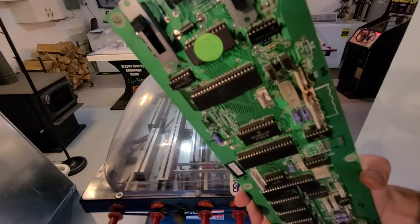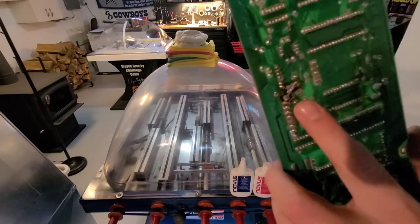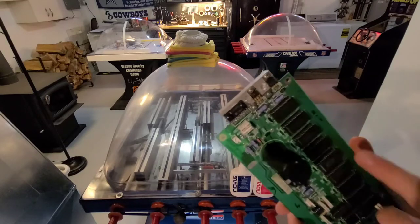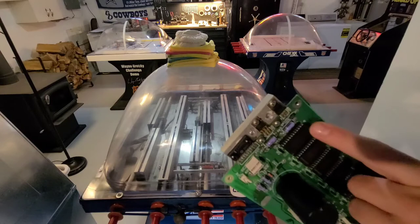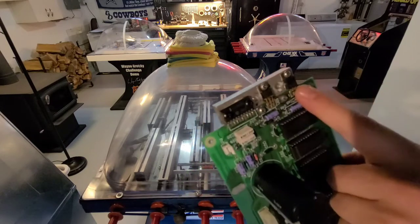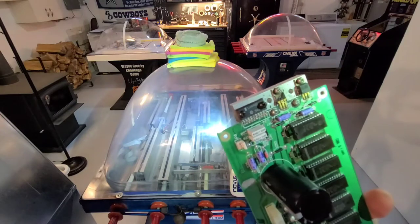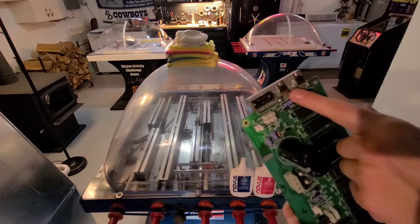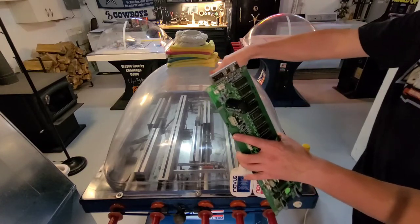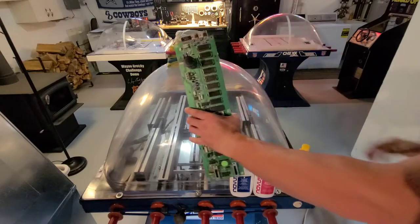You can kind of see it there, all blowed out in black. I'll flip it around — this is what I get to clean up; that'll be for the next video, makes a perfect little segue. Upon further inspection, I found the actual problem: these are the power regulators down here, and this one — U25 — is blowed out. It should look like this one, but it's completely blowed out. We're going to replace this regulator and this connector. This is the 83 board — an original Chex, not the Super Chex or the Super Chex Pro, which have different game boards.